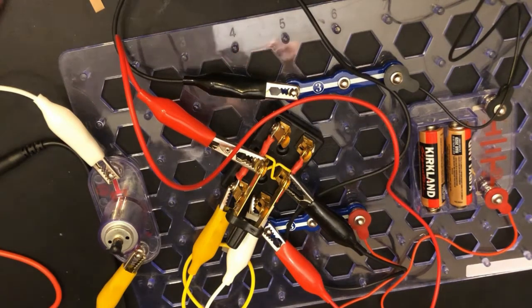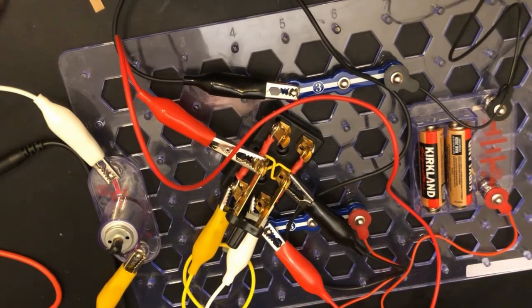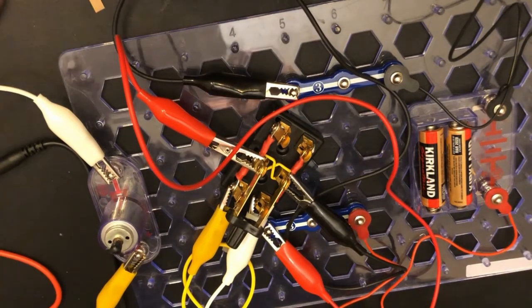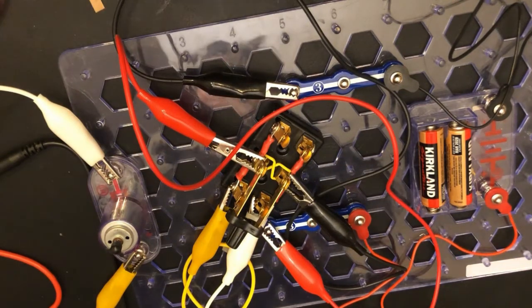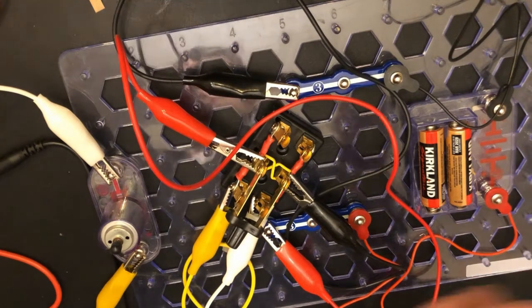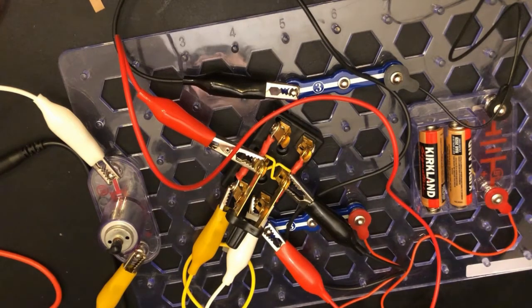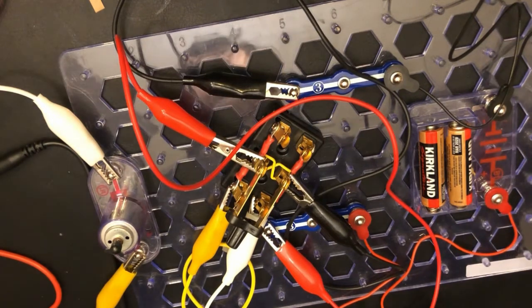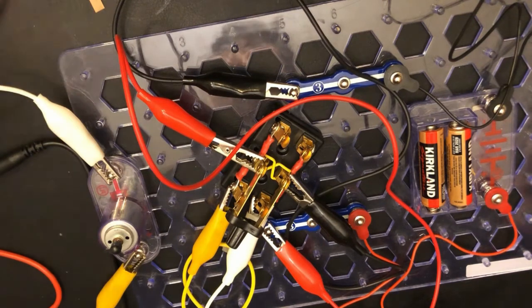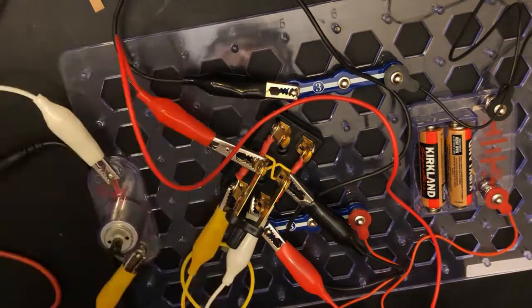And on your pufferfish control box, you would use a DPDT toggle switch. It will be a rocker switch rather than a knife switch. So we're going to write down the difference between a single pole, single throw, and a double pole, double throw switch. A single pole, single throw switch will make it go in one direction. But a double throw will reverse the polarity, which can make a motor turn both ways. So that is it for number 10.